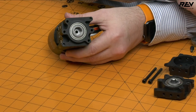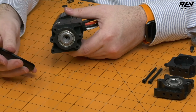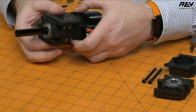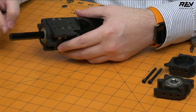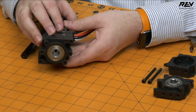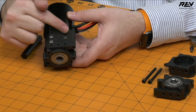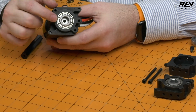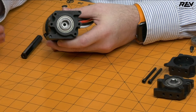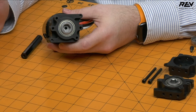One of the first things you'll notice on this gearbox is that it's got a socketed hex output. As opposed to a regular shaft attached to it, that means you can take any half-inch hex shaft and put it in the gearbox, so you can have a gearbox with any length output shaft you'd like. It mounts just like you'd expect — it's got 10-32 screws everywhere on a half-inch pitch, and on the face of the motor you also have four different mounting positions on a two-inch hole pattern, which is the same as a NEO and many other accessories in the FRC ecosystem.